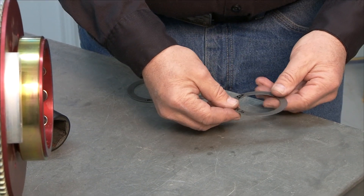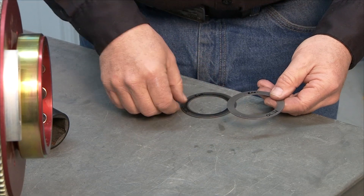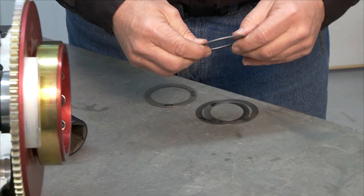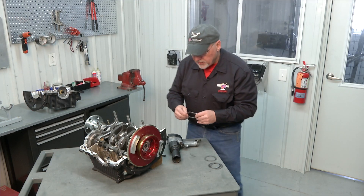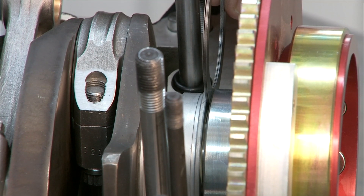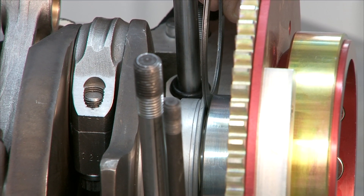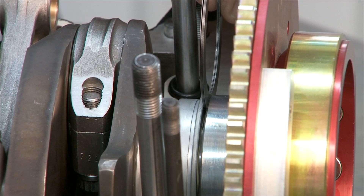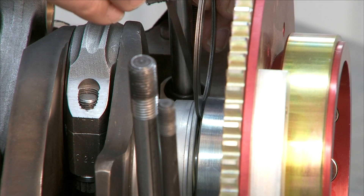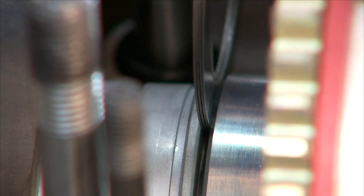I've got a couple of 15 thousandths shims — that's 30 thousandths total. Plus a 13 is 43 thousandths. Plus another 13 is 56 thousandths, and that puts us within our range. I can slide those in there to confirm that makes sense. Those three shims along with about a 5 thousandths feeler gauge should put us right where we want to be. I'm going to take a 5 thousandths feeler gauge and put that in alongside — it should be nice and snug, and it is. It will go in but it's snug, which is exactly what we want.